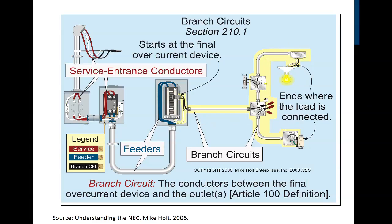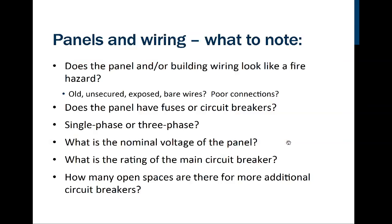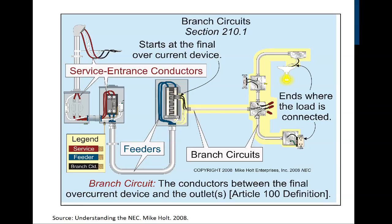Now notice these drawings over here. Notice that this electrical outlet has a hot, a return, and a green wire that's only connected to the box, right? Well, this is a metal box, and that metal box is acting as the ground, so that all these are grounded together. Notice the bonding wire here. This bonding wire is going to connect the white common line to this box, and then because it's got metal conduit all the way through, that is acting as the grounding wire. Most of the time, they will actually pull a bare wire through here to be that grounding wire. They won't just use the conduit. Even if it's metal conduit, most of the time they will use that grounding wire.